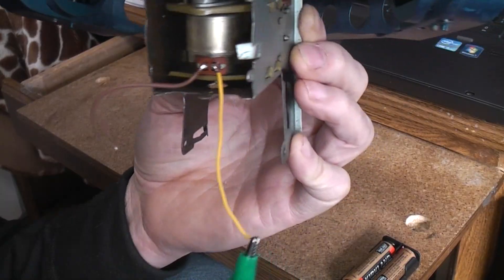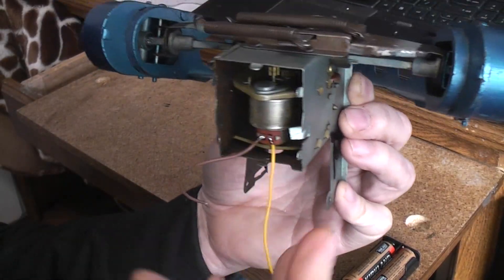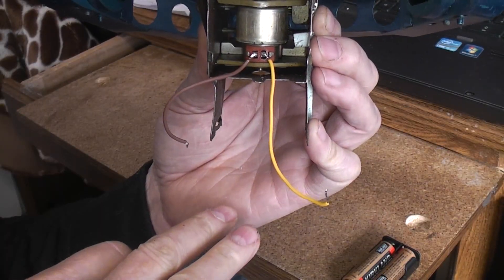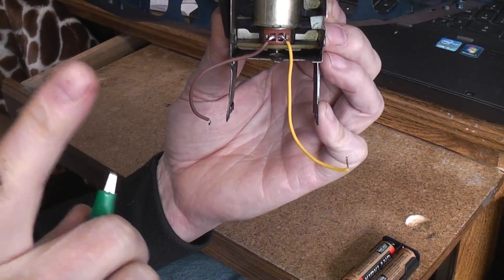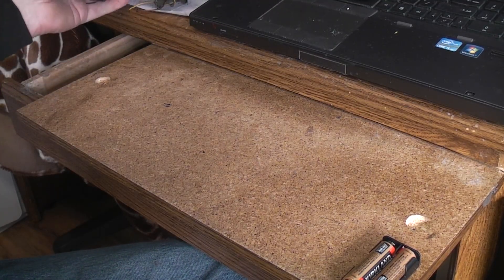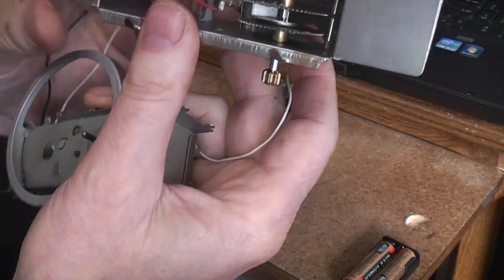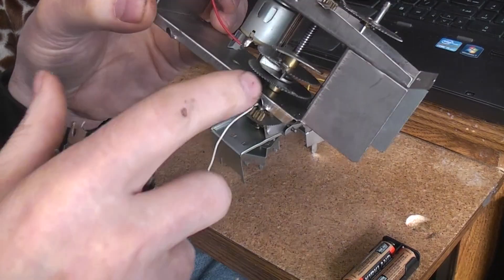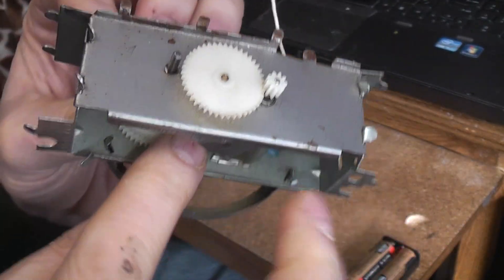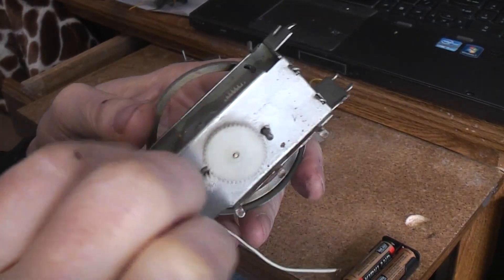This mechanism is normally found on vintage toys with a wired remote control and two push buttons — one button runs the motor in one direction, the other reverses it. It doesn't have to just be hands. This same Mr. Mercury robot uses the same approach in its lower half: push one button and the robot walks; push the other and the robot bends at the waist — two functions, one motor, two gearboxes. The spinning ramp I described is really a cam and lever in spinning form. The most common version uses a gear with a notch cut in it, and the ramp drops into that notch — that's the one you'll see most often.